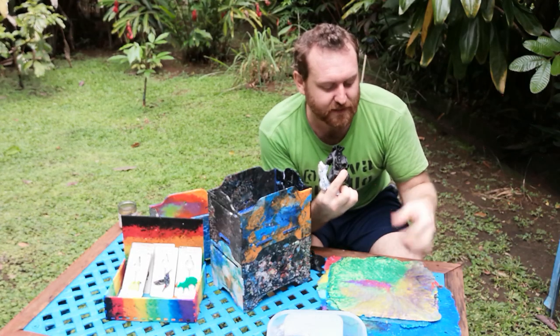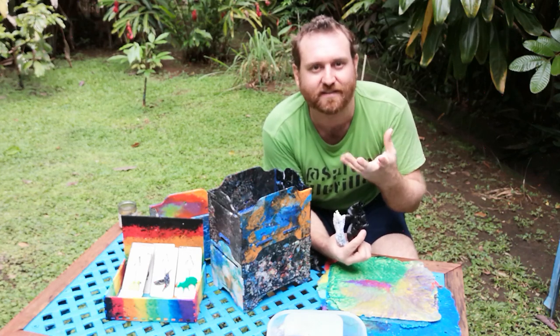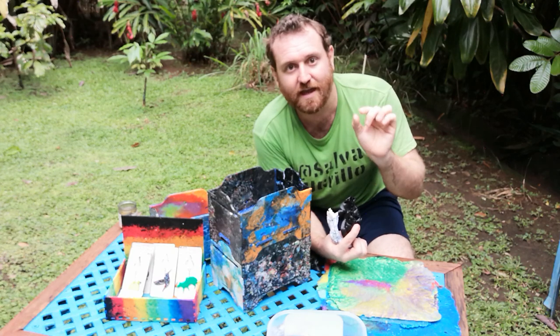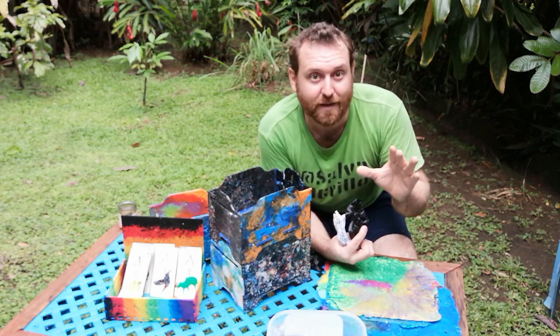Your plastic sheets become kind of brittle and fall apart because you've basically broken down those bonds — you've burned your plastic instead of just melting it. So find the lowest temperature that your plastic melts at. Our PLA has been working great at 350°F for 20 minutes.